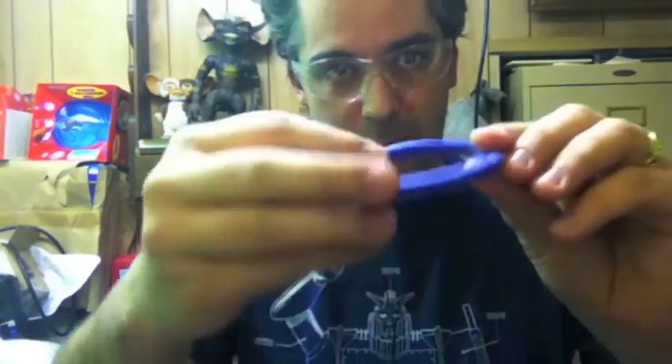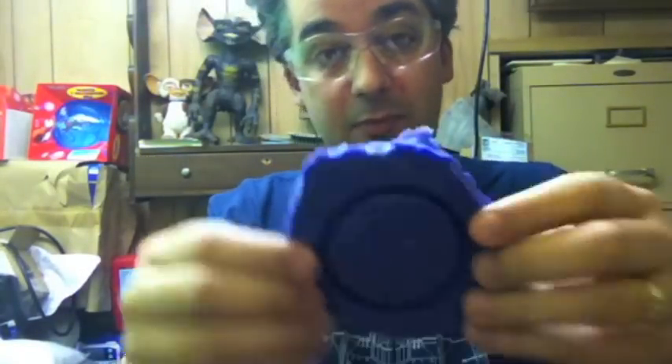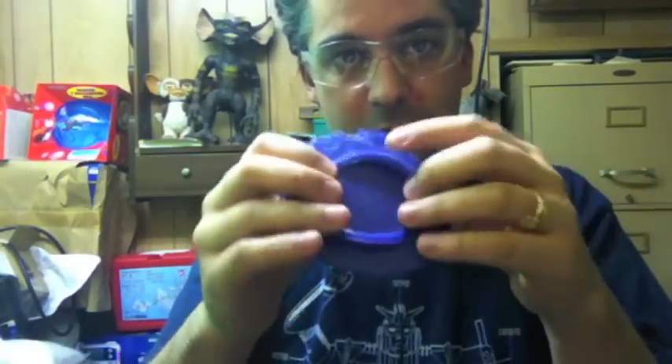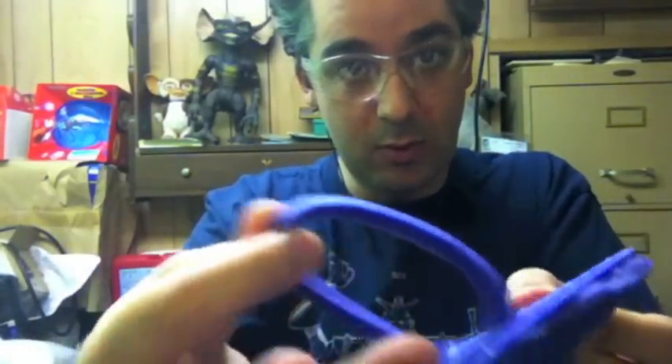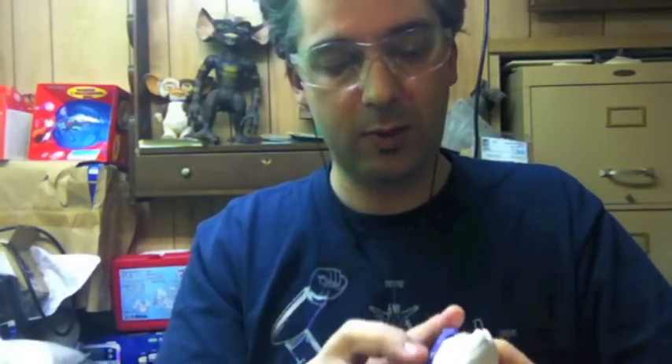What I did was I put this down on my block and sprayed it with Krylon. Then I poured a bunch of Body Double on top of it, so I ended up with silicone embedded in silicone. But since I used the Krylon properly, I was able to just sort of peel this apart and pull it out. I also poured a whole bunch of plaster on top of that while it was curing, to give my mold some support.